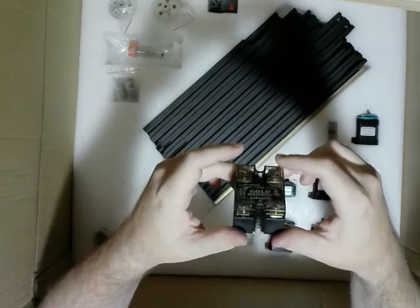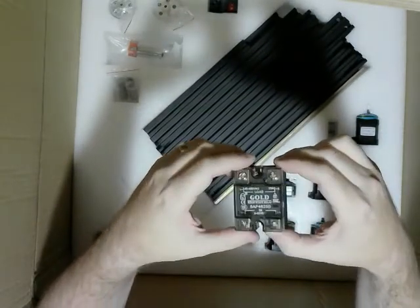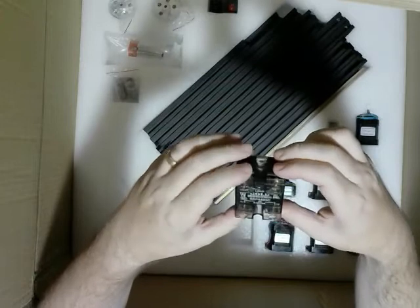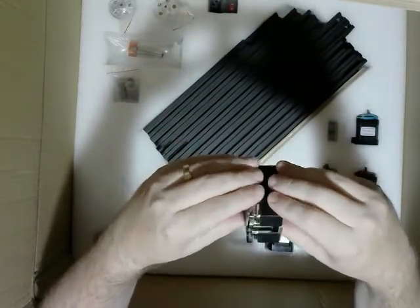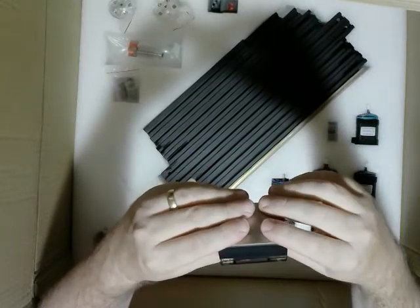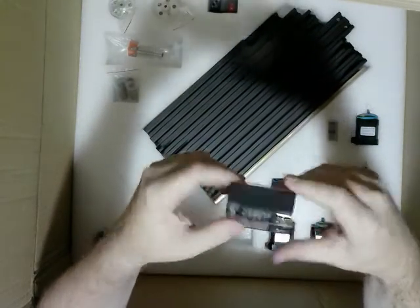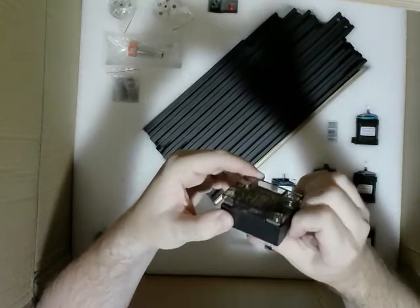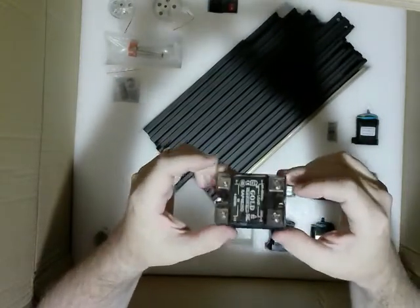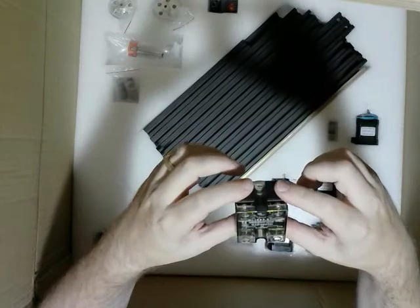Above and beyond that, the other issue is this is a 240 volt component. If it fails, it will probably fail short, which means it will pass current, which is why we have the thermal fuse. And there have been problems in the past with disreputable supply chains and with counterfeits, parts sneaking into reputable supply chains. A couple of the larger name electronic suppliers in Europe have been caught out before by some parts that fell off the back of a truck, too good to be true, and they are something other than an SSR inside. So, grain of salt, someone's reputation's on the line.